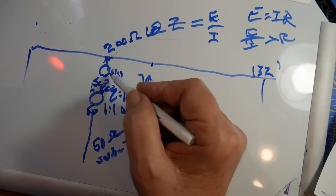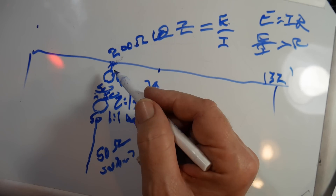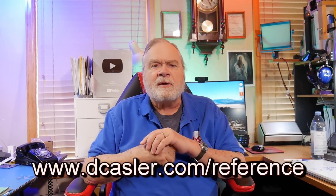The question comes: why can't you just go straight up into the 4-to-1? Well, this is usually a current balun, and you want something that's balanced to balanced. Anyway, this is the way they're made. The reference station antenna for years has been the MFJ 2010, which is an off-center fed dipole exactly like the one you're constructing, with all the same types of dimensions. Unfortunately, with MFJ going out of business, they're becoming very hard to get. That antenna covers all of 40 meters, all of 20 meters, a good part of 10 meters, and some of the lower 6 meter region — all of which can be used by a general. It's a nice antenna, and under $100.